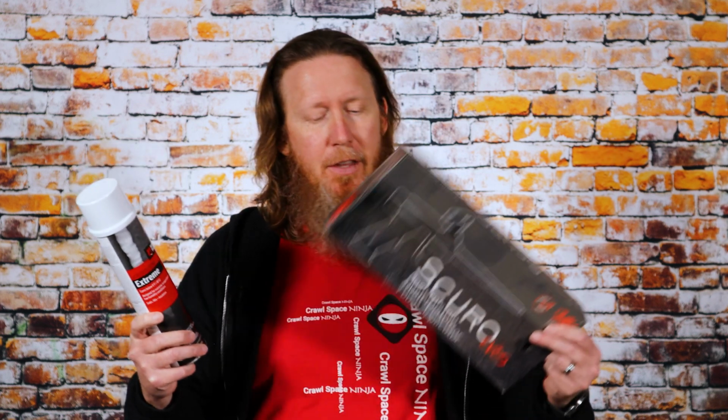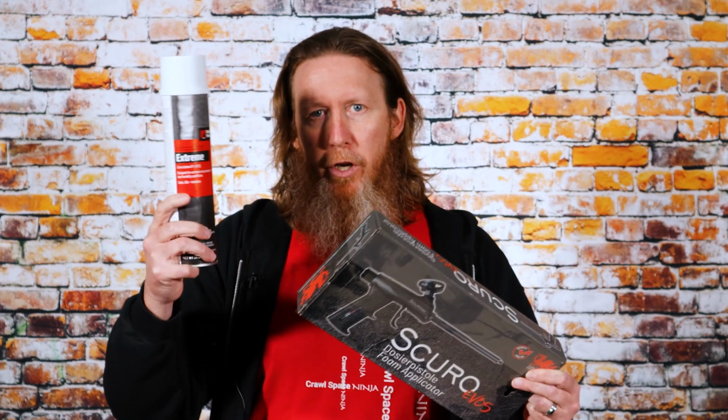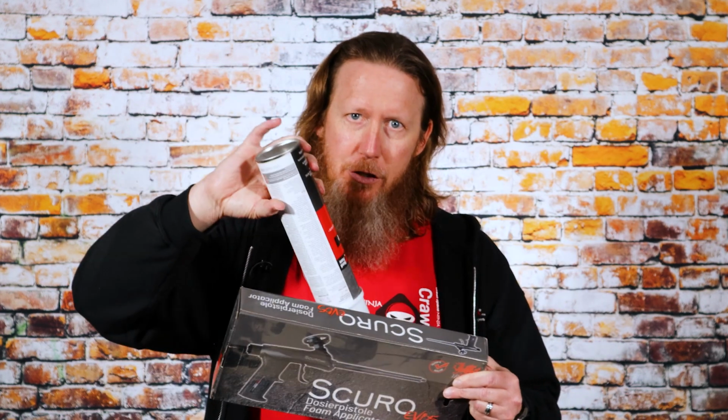Chuck, there's a couple of items you're going to need. Number one, you're going to need a one component spray foam and then a spray foam applicator. The one component spray foam attaches to the spray foam applicator, and then you're going to put beads of spray foam on the brick. Now the problem with the one component spray foam is it does not adhere really quickly, especially if you're dealing with a cold climate, or maybe the brick is cold because it's cold outside or something like that.